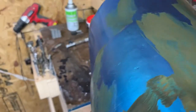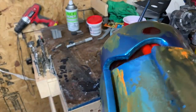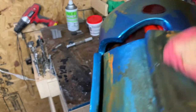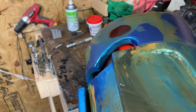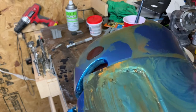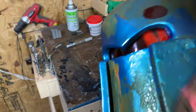Now that we've got a good healthy coat of that paint applied — it should get down into the crevices — let's just take a clean rag and wipe it off. You don't want to get all of it; you want to get most of it though. It's going to take some doing — you've got to wet it, pull it off, dry it off, wipe it off. You're basically cleaning it, and it'll leave the stuff that's down in those crevices.